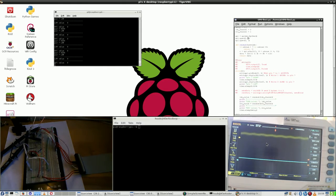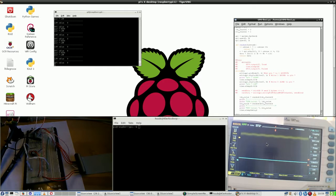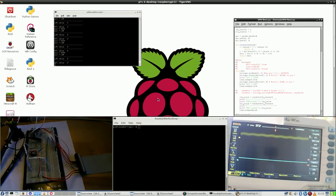Because it gives too many times 0, even with the NTC now, or LDR. When I touch them, it is 0, and that is not the way I expect it to work. So it will work, but the ADC doesn't give in, unfortunately. Let's see if I can change that somehow. So with this kind of result, let me see if I can change something at the oscilloscope.